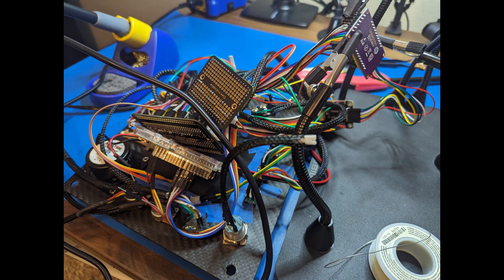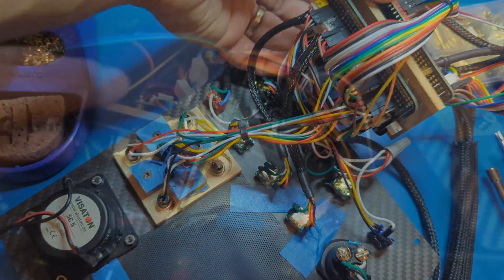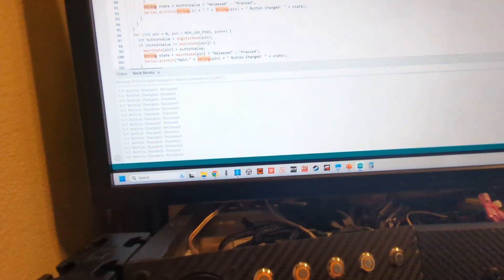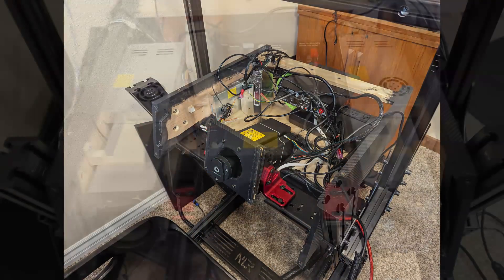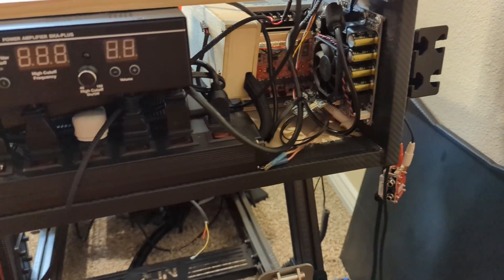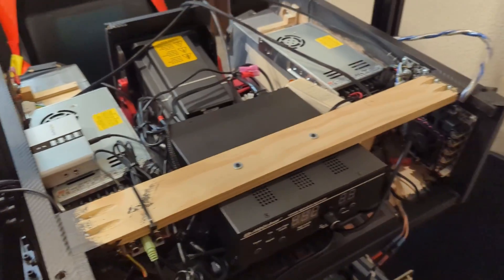There are 160 different connections and they all have to fit in that tiny little space. I came up with a mounting solution for the prototype boards — there are lots of MCP expanders for the Arduino. I was able to ease everything in and check that I hadn't broken a wire or gotten something loose. Next it was time to build everything back up. Here are the relay connections going to the left side of the dash, the subwoofer amplifier, the rear speaker amplifier, and the Butt Kicker.